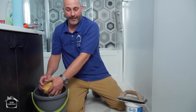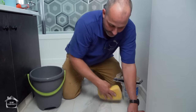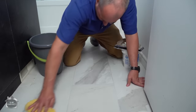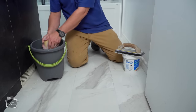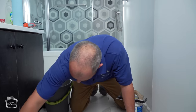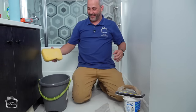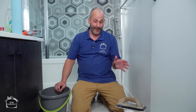Since you're riding over top of a surface of basically dish soap, you don't get that epoxy haze building up on the tile. Just like other floors, you drag it and flip the sponge and drag the next spot — and that is done. There's going to be a lot of people watching this going, 'I can't believe epoxy is that simple,' because they never used the soap. And that's the secret — once you've used it, you'll never go back.